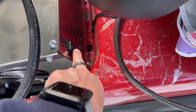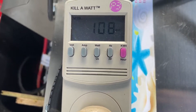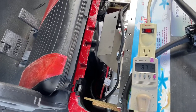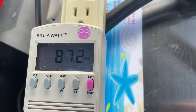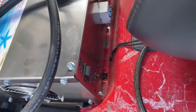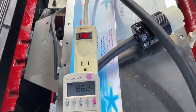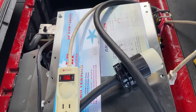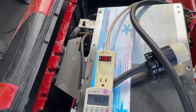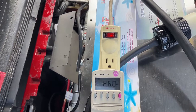I have it hooked up, turning this on — you're going to see the green light come on. We're sitting at 40 watts, then 108 watts — that's basically just the fan running on the air conditioner. It will take about two to three minutes for the compressor to come on. I saw the alarm light flash and then it just resets. I almost have to laugh at the advertisement of this thing — the low-frequency inverter is supposedly designed to start motors. This was a newer air conditioner, hooked up to a 3,500-watt battery bank at 55 volts, and it couldn't start it.